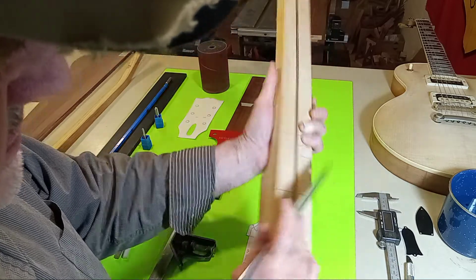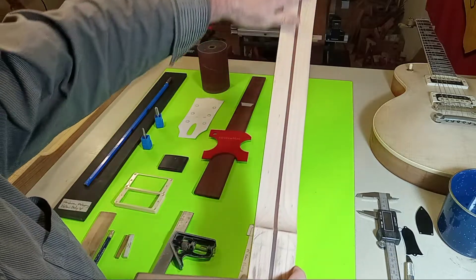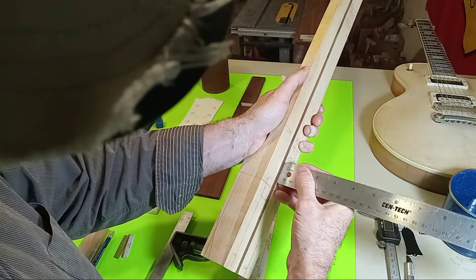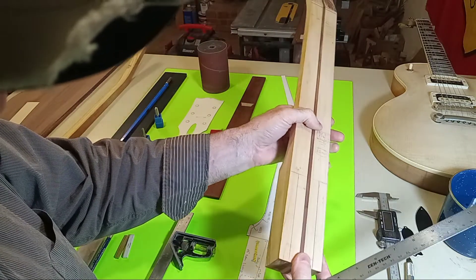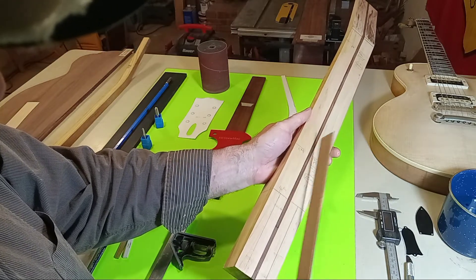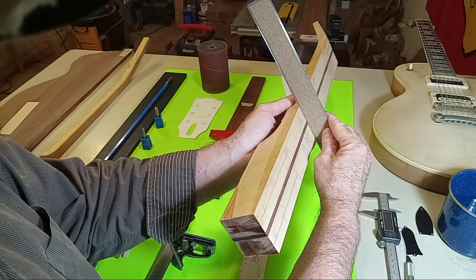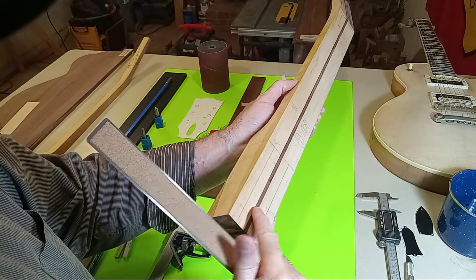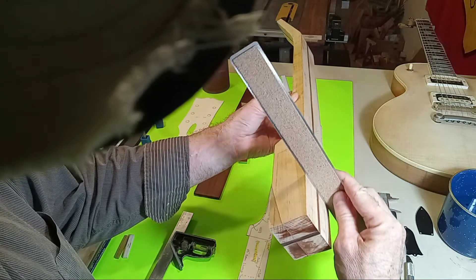I was watching to make certain I was proud in these areas and intentionally kept it a little bit lower than that surface by about a 32nd of an inch, because I did not want it to interfere with the level once I glued the base leaf to the treble leaf. This is all going to get routed out in the middle anyway, so it doesn't matter. Keeping it nice and flat right there is critical.